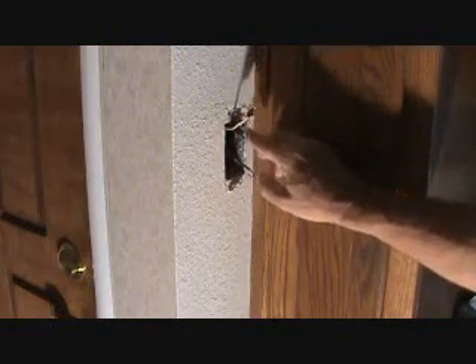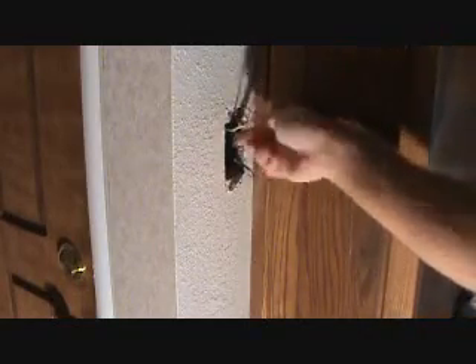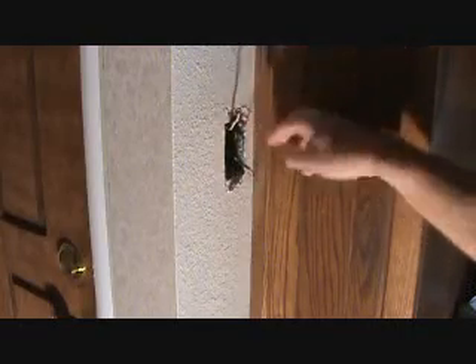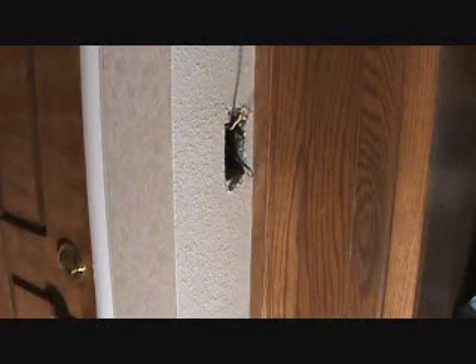This white wire has got a little black piece of tape on it — they didn't do a very good job on that. That black piece of tape means they were marking this white wire as a power wire, just like a black wire. So we know there's power coming into this box with one wire and power going out up to the light switch with another wire.